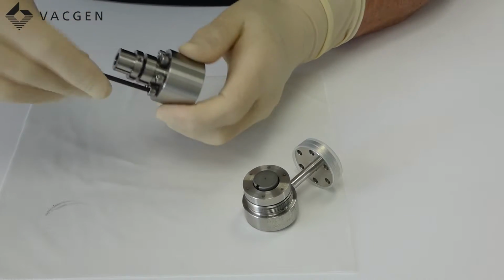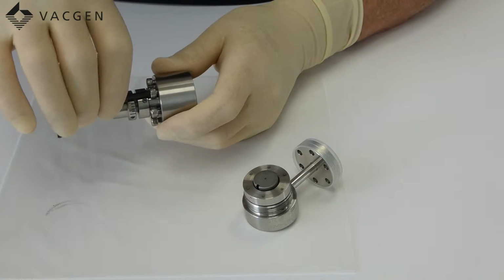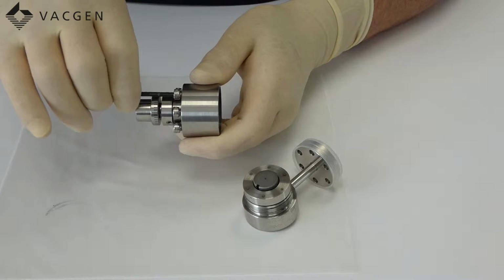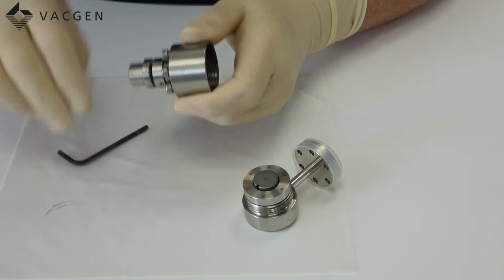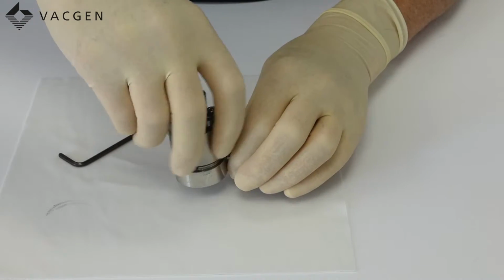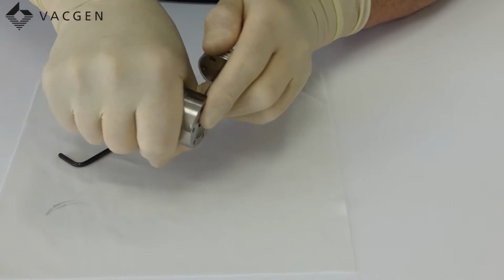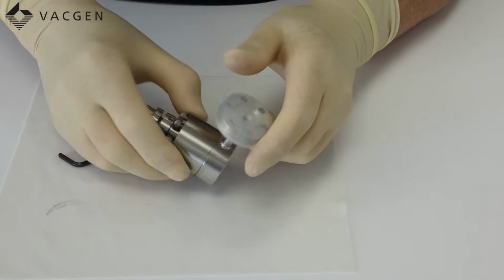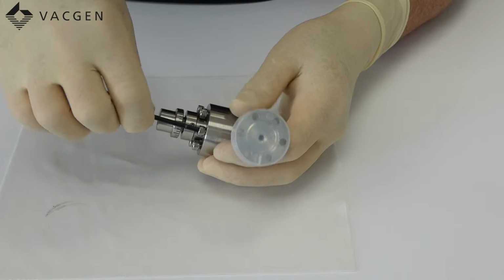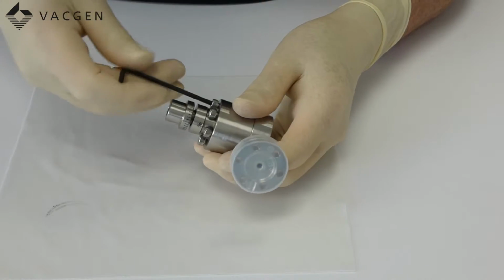Just before you do, just wind them back a little bit more, just to make sure that they will be clear of the inner assembly. Once that's done, carefully lift the valve up and just screw the two parts together. And the faces of these should be face to face. As such. Now, to seal the valve off, again, be very careful with this because you don't want to overdo one side. So just do the screws up until you can feel them touch down on the ring below.